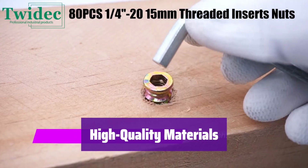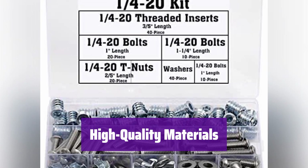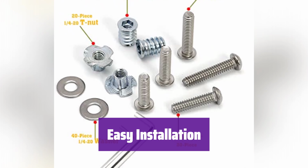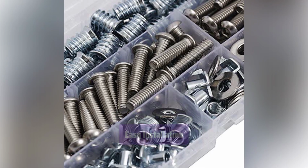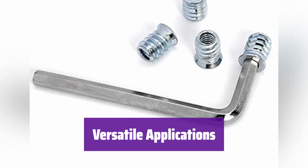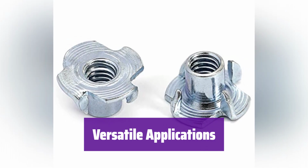The threaded inserts and T-nuts are made of durable zinc-plated carbon steel. The bolts and washers are stainless steel for superior corrosion resistance. Installation is straightforward. We provide the correct drill bit sizes for both soft and hard woods to ensure a perfect fit every time. These fasteners are ideal for furniture making, repairs, and countless other woodworking projects. They create a flush surface for a professional finish.